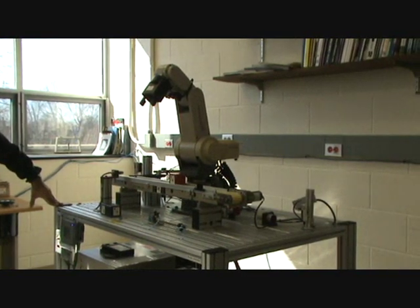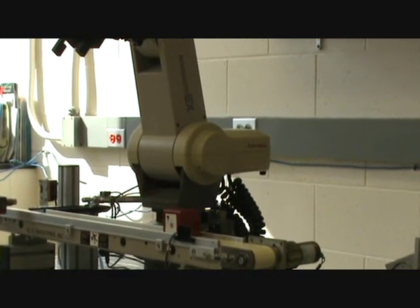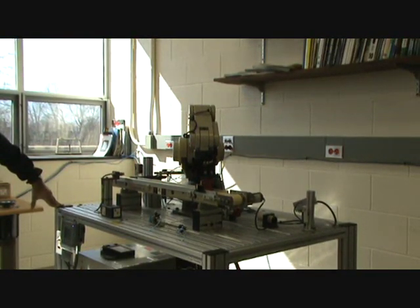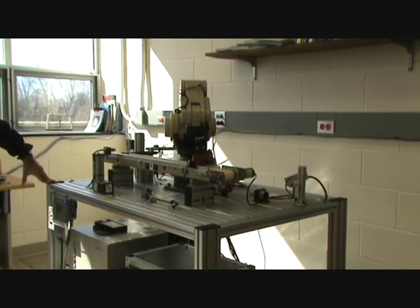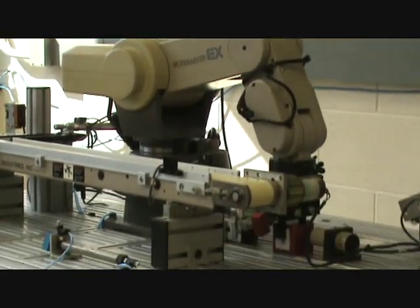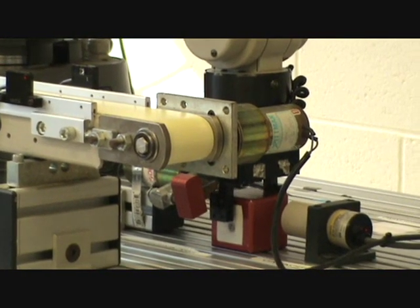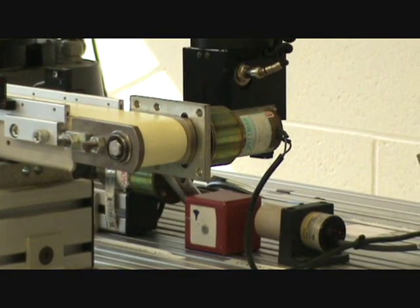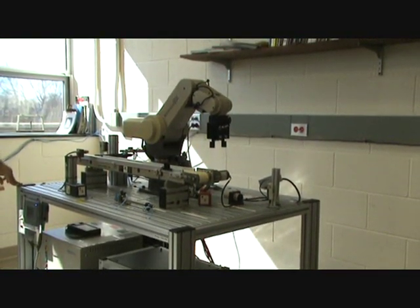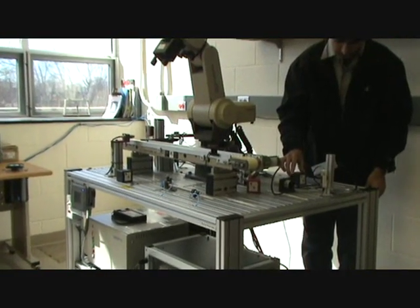Now we have a metal cube — it is detected by the system and moves along the conveyor belt. The track sensor detects it and sends a signal to the robotic arm. The robotic arm picks up the metal cube and unloads it to the metal cube unloading area. Once unloading is done, the gear motor starts running and moves it out of the unloading area, and the robotic arm returns to the home position in the middle of the conveyor belt.